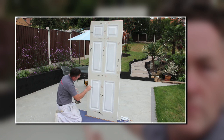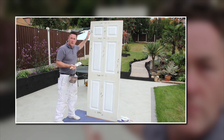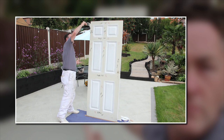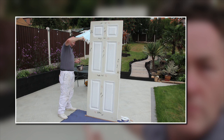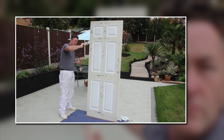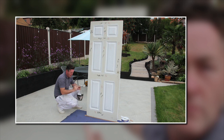Not much paint on the brush there, so I can just knock those off now — they're all drying off nicely. I'm just going to paint that door edge — that's the hinge edge; you could do that first or do it at this stage. Obviously there are no hinges on it because it's a sample door. It looks like it's been planed — it's very furry. That first coat of the acrylic will dry nicely so when you put your next coats on you can just rub down that coat of paint, scrubbing it in because it's a bit furry and woolly. For more information on the parts of the door, please look at the previous video.